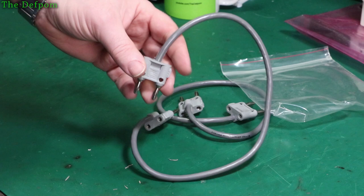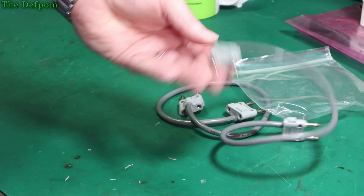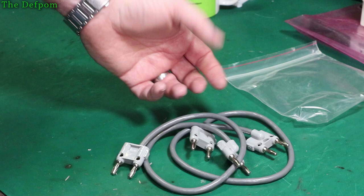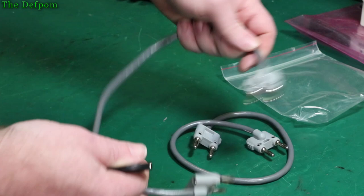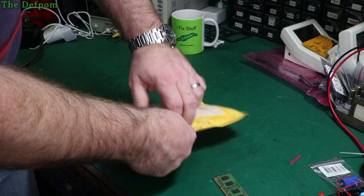One of the things I didn't notice when I purchased these — it's my own fault — is that there's actually no guard cables on these. They're not guarded cables. They're probably shielded, but there's no guard wires, so you can't actually use guarding. Whereas my other cable does have a guard wire. Anyway, it's too late. So at least I've got some interconnect cables which are probably fine. Nice and short — you don't always need guards and sometimes it's a bit of a pain anyway. They'll probably do for doing some calibration work.